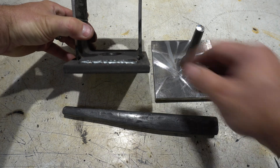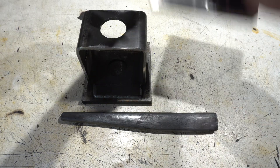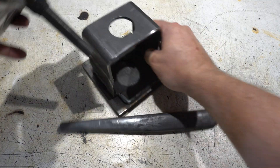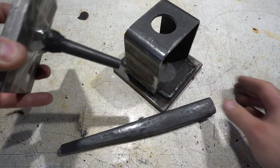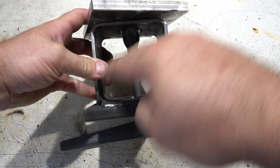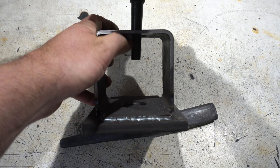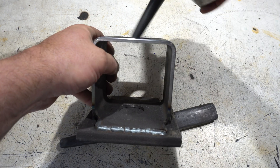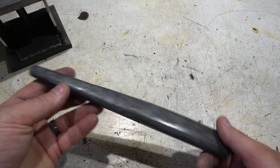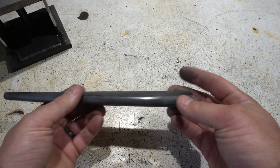So here they are all finished. I've got the bottom plate with the hole in it and the hole in the bottom. This is my punch, which is going to come down from the press on top and go into this like this so you can see it. Your piece of steel will go in here, this will compress it, and then as you pick it up the top will knock it off and it won't get stuck. So that's the punch, and here is the finished drift. Of course, you use the drift after you punch the hole — this goes in and you widen it to the shape that you want.